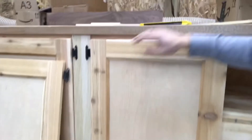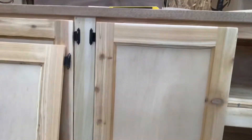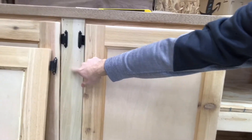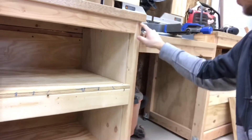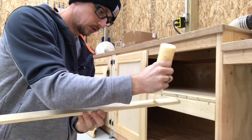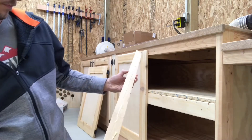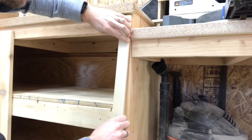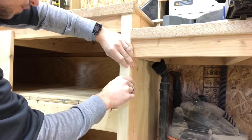I have the one door up. What I did is after putting the hinges on I just laid my level across, made sure that part was level and made sure I was level here. But I have to go ahead and add some poplar for the spacing — I have a chunk of 3/8 poplar here at the thickness I need — so I'm just going to go ahead and cut it and tack it on here with a little bit of glue and some nails.